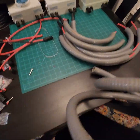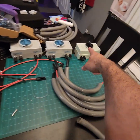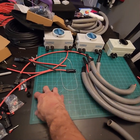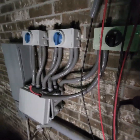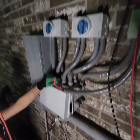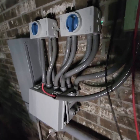So I'm putting Brittany to work. She's making all of these ends for me that will go down from each connector. These are the emergency on-off PV connectors. They'll go down into this box that will go through the wall outside. Brittany and I are out here in the middle of the night hooking up the PV cutoffs. She did all of the conduit cutting and she's terminating these inside of the box.